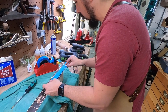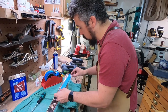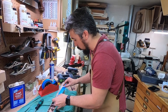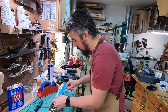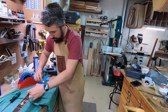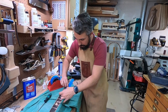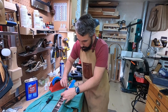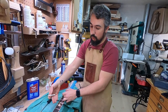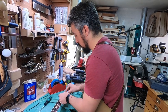The other part is thinking about the full process. Once this lacquer is dried for a couple of weeks and I go to buff it out, I'm going to be spraying it with water and wet sanding, so I don't want to get a bunch of water on the bare fretboard. This seals that all off — I don't take this tape off until after I've buffed the instrument. I have sprayed instruments for other people who did the whole lay-the-tape-on-top-of-the-frets masking, and I didn't have issues with overspray but I did have issues with water getting up underneath it once I was buffing.